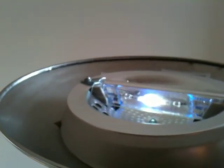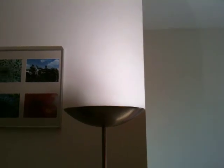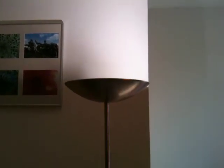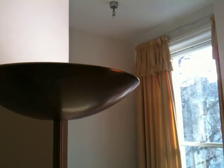There we go — lighting up. So there we have it: 6,000 lumens of light for 70 watts of power, quite a reduction from 230. It's a pretty nice light — very white. This is a 4,000K HID lamp, so it's slightly whiter than your normal halogen, but still reasonable. It's not blue like those cheap HID lights you get in cars.